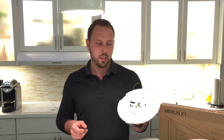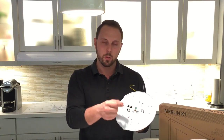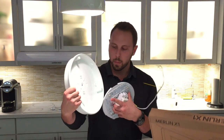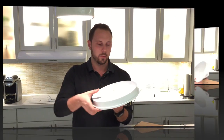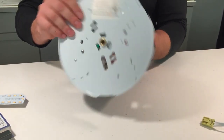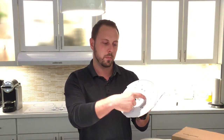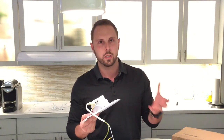Going to the back, there are two different ways this can be installed. The first way is using a brass insert and a brass screw-on nipple included in the kit. On an example drum fixture, you can see that central hole right in the middle — you simply come up to the fixture and screw in that brass fitting on the back. The second installation method uses key slots that match up to the holes in a standard fixture's keyhole slots, designed to mount to a junction box. It can be sandwiched using the same screws that typically hold those keyhole slots — no drilling or self-tapping screws required.